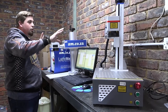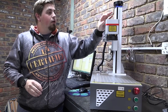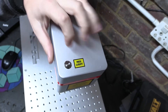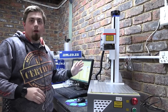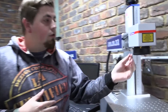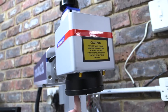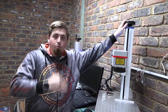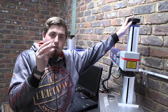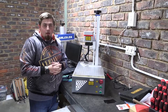Looking at the two units, the arms are exactly the same. The two differences between old and new are: first, we have a frame tool button on top that allows you to see the laser and switch it off when you don't want it, so you can focus without having to go to the program and click frame. Second, looking at the head, our old one has only two focusing lasers whereas this one has three - two on the outside and one from the inside - giving you a tri-dot laser in a triangle formation. You use your lifting tool to raise or lower it, and when the three dots converge into one dot, your laser is focused.